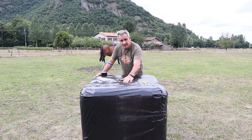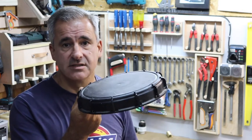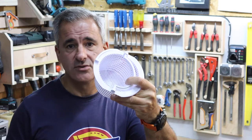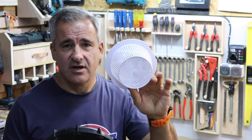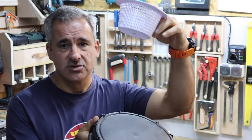So now I'm going to do this hole here, which is the water inlet. Back in the workshop, I'm just going to cut the hole in the top cap of the inlet for the IBC container to take this filter. It's a swimming pool filter that I found in the local DIY store — very cheap, about 6 euro. So we're just going to cut a 125mm to 130mm hole in the top of this, and then that should slot in.